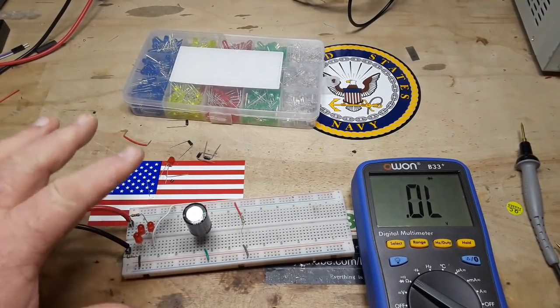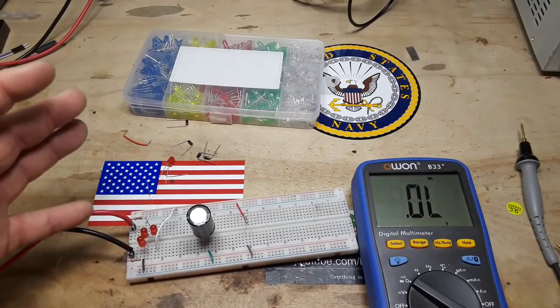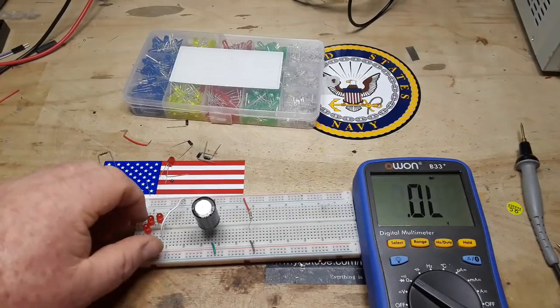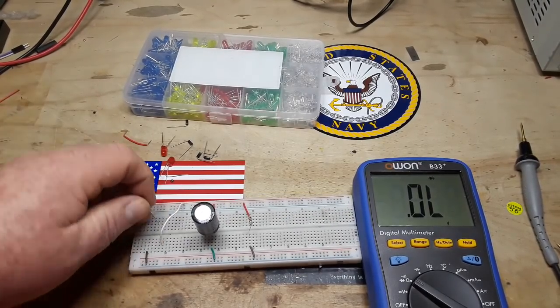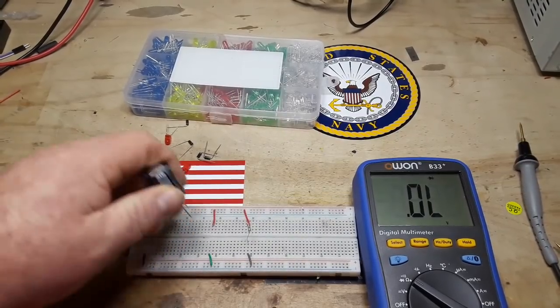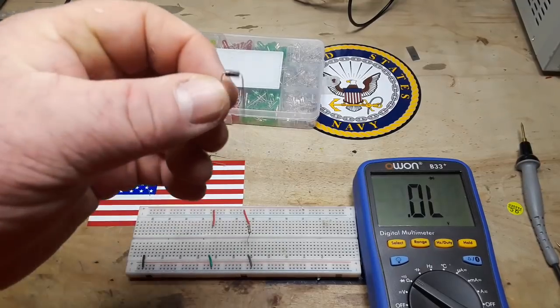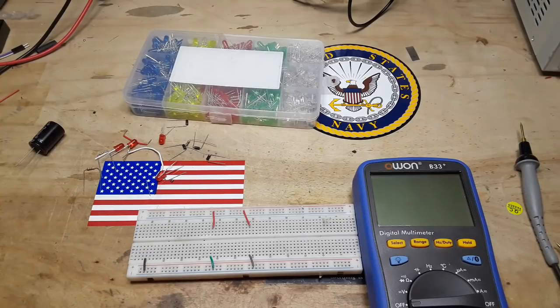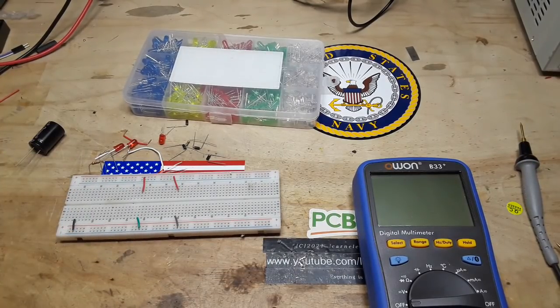So, if you can keep the reverse voltage below the maximum for your LEDs — and like I said, even good quality Vishay LEDs only have a maximum reverse voltage of 6 volts — it's just not worth it. Yeah, you can do it, but why would you want to? There are parts made specifically for this, specifically the 1N4007, which is known as a rectifier diode. Theoretically it's possible; practically, don't bother. I hope you guys enjoyed this. If you did, give me a thumbs up, feel free to comment, share, and don't forget to subscribe. Big thanks to all my patrons who make this channel possible — a dollar a month is all I ask. I'm out. Peace.